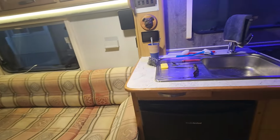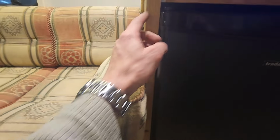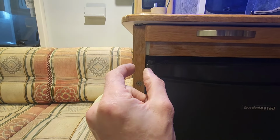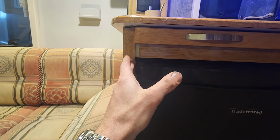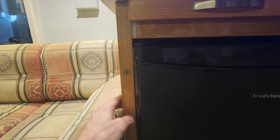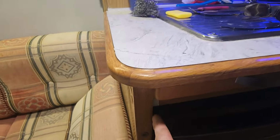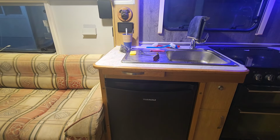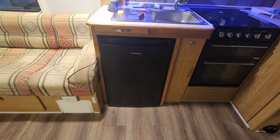The other thing that I had to do is, this fridge is that much wider than the old one that even here there used to be a trim that came out, or a lip that came out, and it held another bit of trim. That was plastic, and I just chopped that plastic flush with the wooden trim. The plastic is actually this bit here, it folds around and it had a lip. But the fridge is occupying all that space now, so I carefully did that with my multi-tool and then very carefully sanded it all off, and it all came out good.